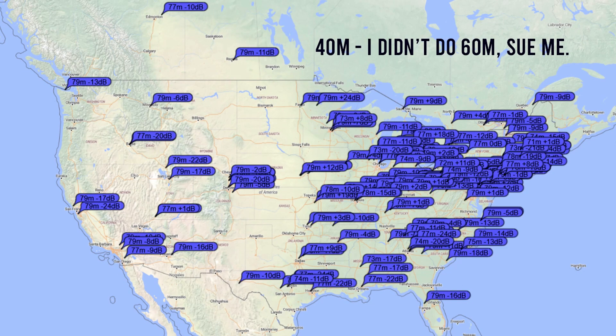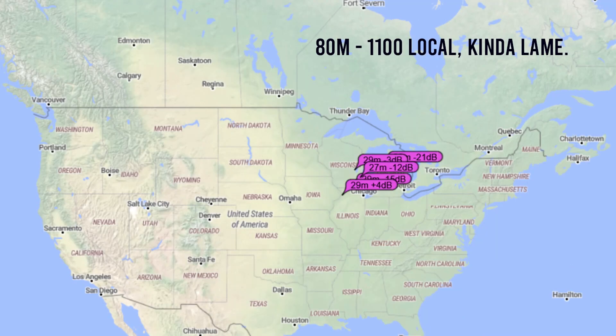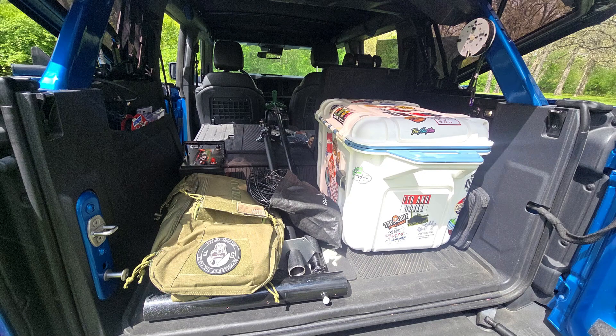If you are planning on using this antenna in the field, here are a few quick tips that made a big difference for me. First, get that feed point as high as possible. This doesn't just apply to this 80-meter NFED half-wave, but really any antenna. It helped especially on 20 meters, and made the antenna perform more consistently overall. Second, bring at least two solid support options, or if you're confident with it, have a good arborist throw line ready. Using clampable masts helped me reduce the sag from the heavier wire, while still keeping the antenna wire high and reasonably tight.